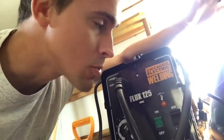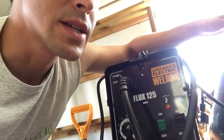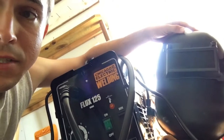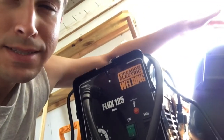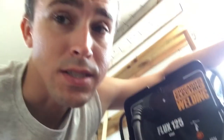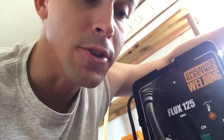If you've never used a welder before, everybody says you're gonna go blind, but I don't think so — it's not that bright with the hood on. You do have to have a helmet; I wouldn't go too much brighter than shade 10 in my personal opinion. Indoors it's okay, you can still see what you're doing. As long as you've got your hood on with an appropriate shade, it's not going to blind you. Shade 9 is like a lightning bug; shade 10 is more like candlelight — I could see better and it didn't hurt my eyes.